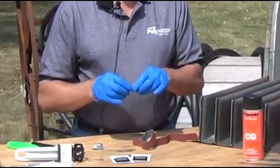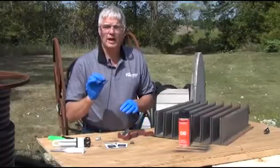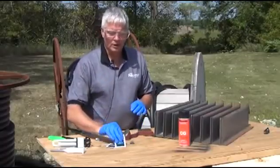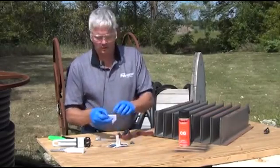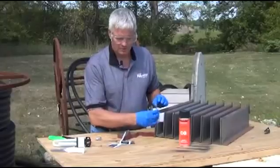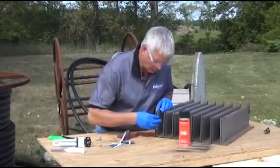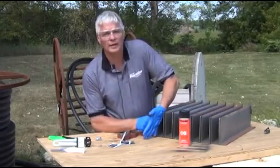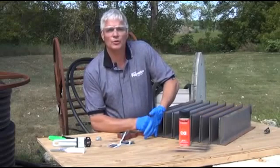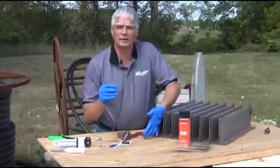For this demonstration, we'll use a pea-sized piece of putty. Right before you put on the putty, clean the area with a TR solvent wipe to remove any oil. Place the putty over the leak and use your thumb or the palm of your hand to hold it for about two to three minutes while it gets hard. Use the excess putty to judge when it is hard.